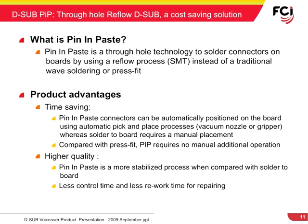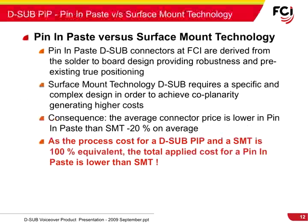Pin-and-paste allows for the same time savings as when employing pick-and-place machinery, as well as the higher quality of soldering found in surface-mount terminations. It provides the same benefits of SMT while maintaining the cost savings aspects of through-hole technology. The same layout and hole diameters used in a through-hole design can be used in pin-and-paste, avoiding the complexities involved in surface mount, while making it more robust and still offering the same true position.